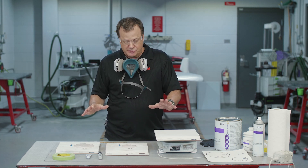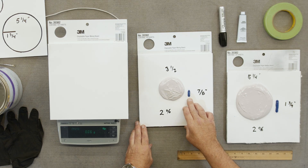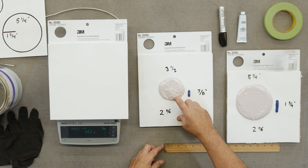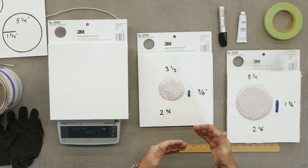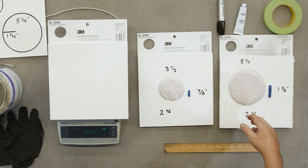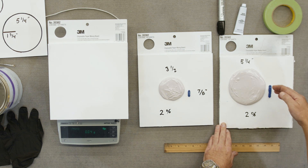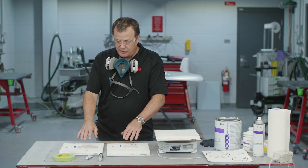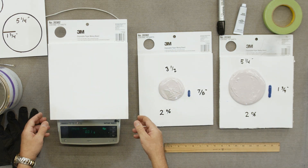Keep that in mind when looking at all this. The way I mixed it, I ended up with about a seven-eighths inch bead, and measuring it, it's about five-sixteenths, so it wouldn't go very far across that puddle. If I made a much skinnier bead, it would probably span much farther. So again, it depends on your personal habits and how you squeeze it out of the tube. For a little over a five-inch puddle, I ended up with one and three-quarter inches for the hardener length — both examples are at 2%.